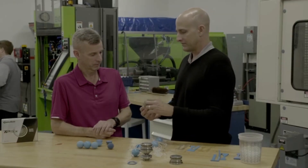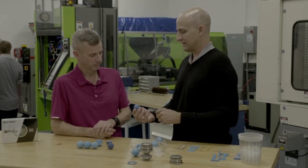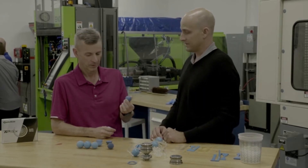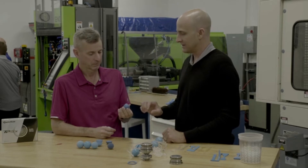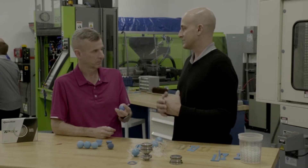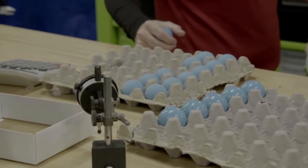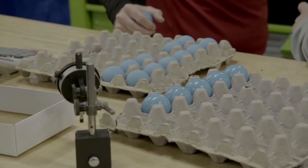Those preps get placed into a core cavity press where they're formed and cured under heat and pressure, and the output from that operation would be this part here — that's the inner core. You can see that there's some flash on there and it's not going to be perfectly round. We go through a process called centerless grinding — the same process used for billiard balls — to make sure it's round and set ourselves up for success on the next operation.